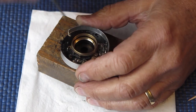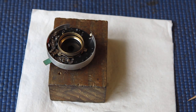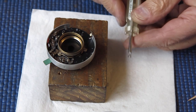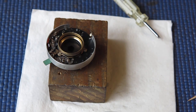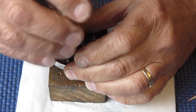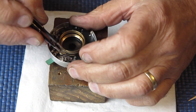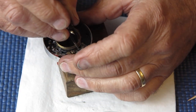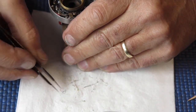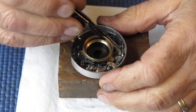I want to remove this spring. I'll put a toothpick over the shaft while unhooking the spring so that it cannot ping off into the distance — because they're very small and very prone to disappearing. I want to remove this screw, which is a post with a little notch either side. I've got a suitably modified screwdriver — basically a screwdriver filed down and then with the centre notched away with a Dremel; you could do the same with a file. I'll unscrew that post and its spring, remove the B lever, and also remove the B lever return spring.